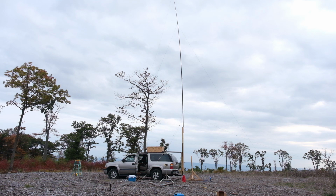So I switched out for the vertical with raised radials, which worked great. I was really impressed with this mast because I could take a wire off the top for an L on 80 meters, and I got 5.9 reports in Nebraska and 5.5 reports in Washington, which made me really happy. So the vertical worked as a resonant antenna, worked so much better without a tuner.